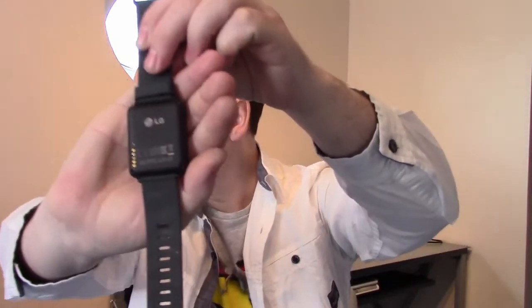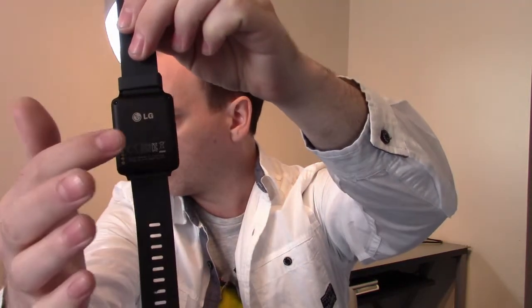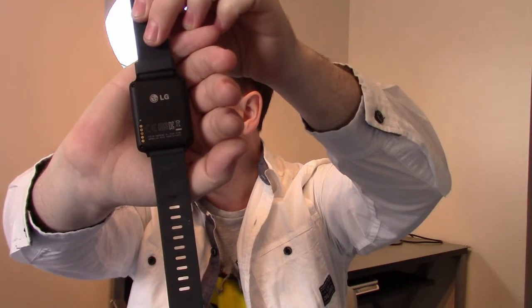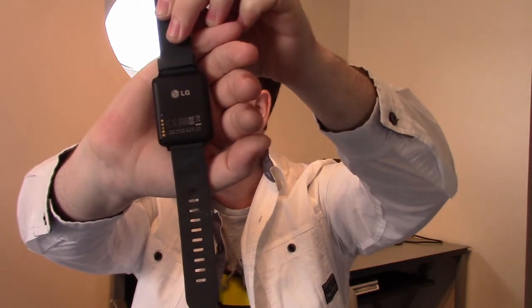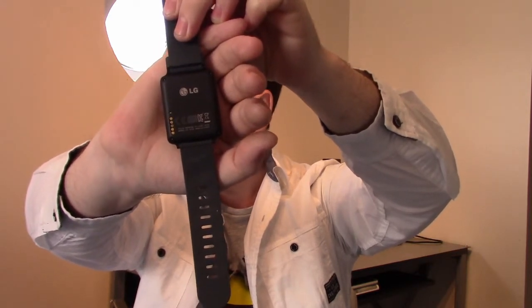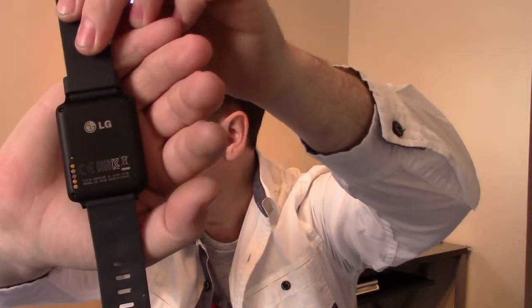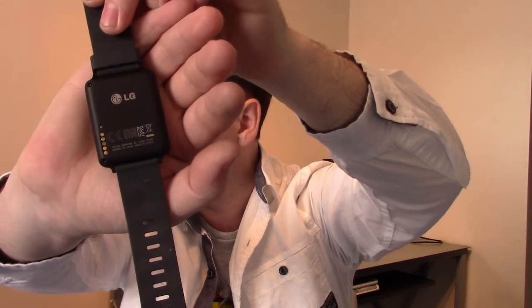I'll show you — I'll just take the watch off. Now on the back of the watch, as you can see there are five pogo pins and then there's the reset button at the very top. The top pogo pin, which is near the reset button, is ground. The second one gives out 1.8 volts and the one below it gives out 1.5 volts. The other two — well, one of them is data, and the very bottom one I know is 5 volts in. You can see the pins are not all the same colour.